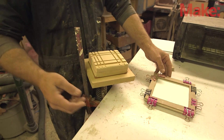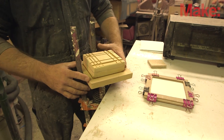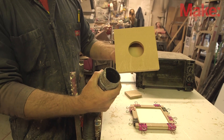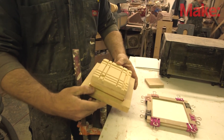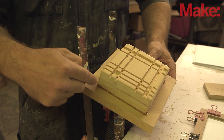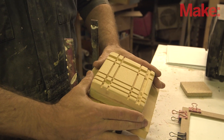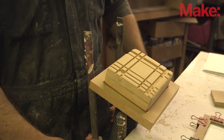For the demonstration I've made the world's simplest vacuum forming machine. This is just a block of wood built hollow so I can attach it to the shop vac. On the top I've grooved it out in a couple of different directions, and everywhere where the grooves meet I've drilled a hole through. So it's a hollow box with a vacuum attached to one end — we put our form on it, stretch a sheet of plastic over it, suck the air out, and we end up with the shape we need in thin lightweight plastic.